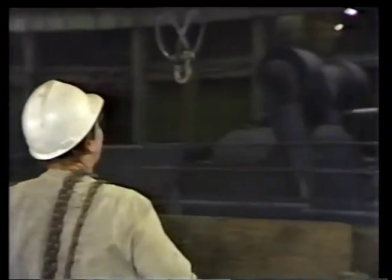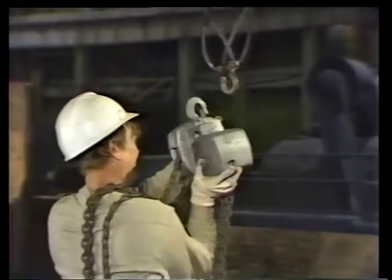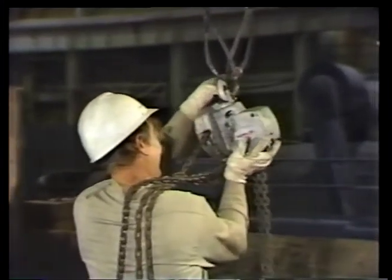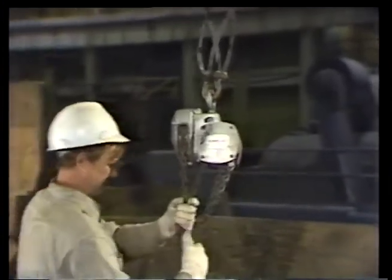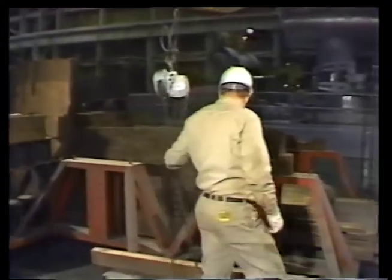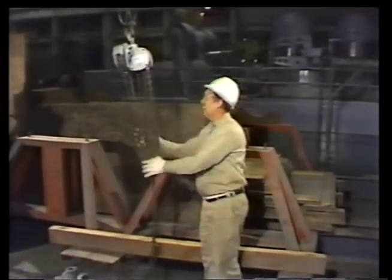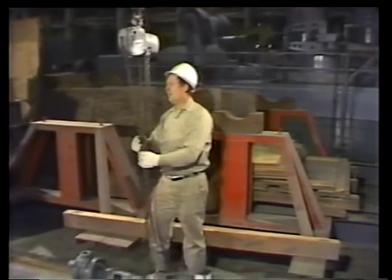The hoist is hung from a sling and shackle connected to the load hook of the overhead crane. Norris is using a hoist for this job because he has tight clearances, both where the load is being picked up and where it's to be lowered through the shaft. The hoist will enable him to control the lifting and lowering of the load more slowly and precisely than would be possible with the overhead crane alone.